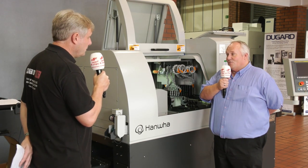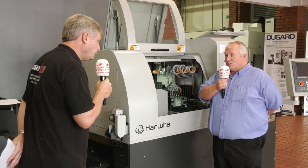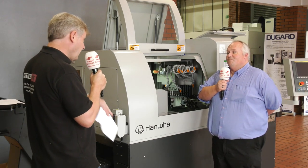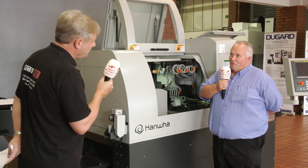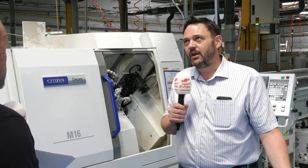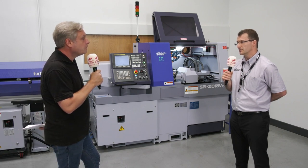We do an awful lot of prismatic parts on sliding heads — it's a very effective and efficient way of producing those parts. Depending on machine configuration you can cut two or three faces at one time, do pinch milling and pinch turning: cutting from turret and gang at the same time, drill and turn simultaneously. Sliders are invariably very fast machines — everything is compact, tools are right next to each other, so idle time is not there. A great example: a job taking five minutes on a fixed head was taken down to two minutes two seconds per part, complete and deburred, coming off the machine.